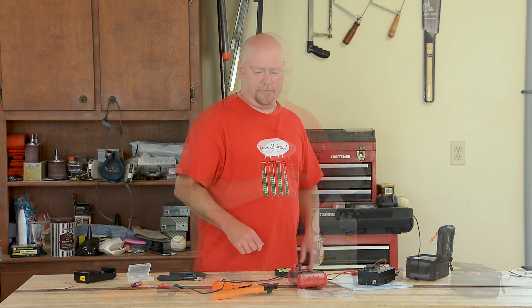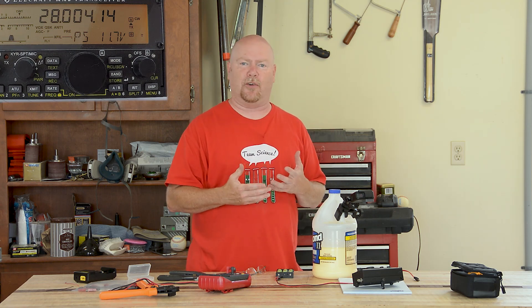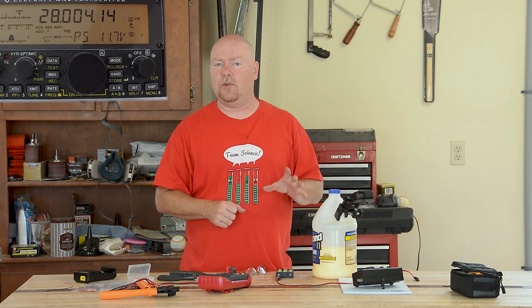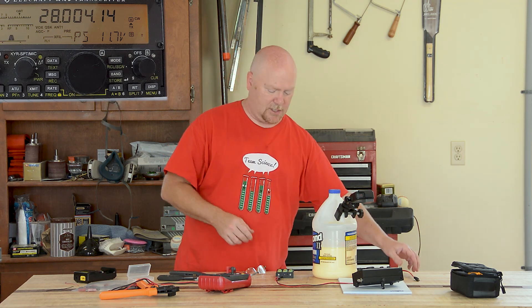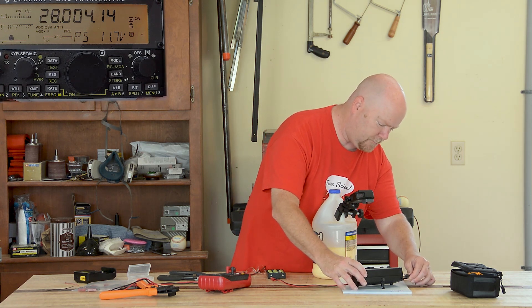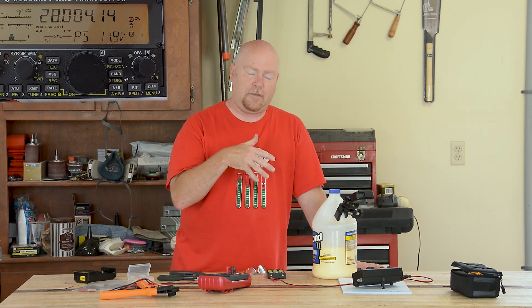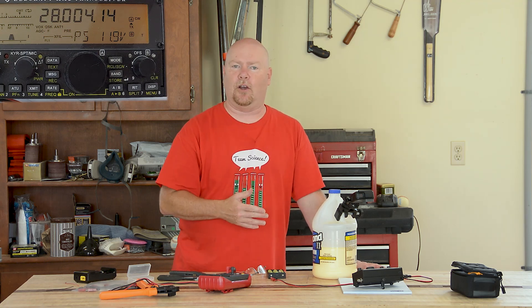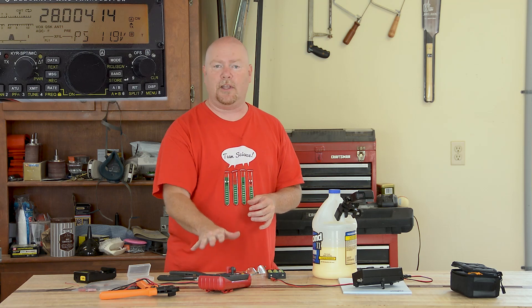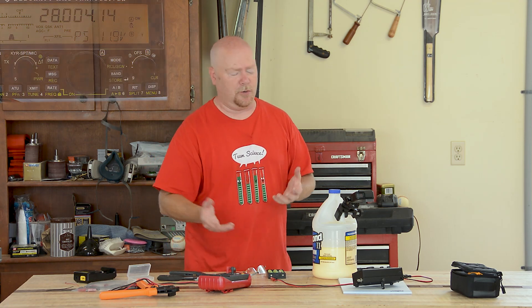The only thing left to do is hook the radio up and see if it likes it. The KX2 right now says 11.7 volts — that's its measurement of the internal battery voltage under receiving load, with no antenna hooked up. I got my power poles connected, let's plug in the other end of this wire and see what the KX2 thinks of this battery pack. 11.9 volts — to me that is ideal. We've got three batteries of the same chemistry feeding the same radio. The measurement circuitry should come up with about the same voltage. That it differs from what the multimeter shows doesn't bother me, because now the batteries are under load, whereas the meter, not so much — plus, Harbor Freight meter, so who knows.